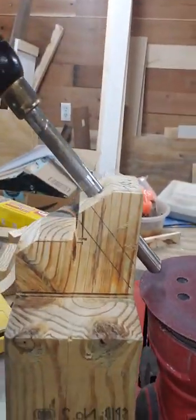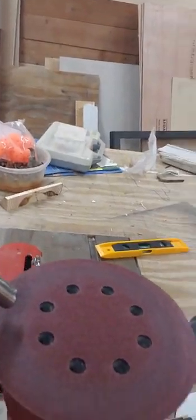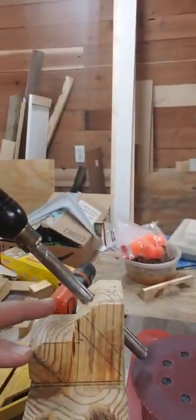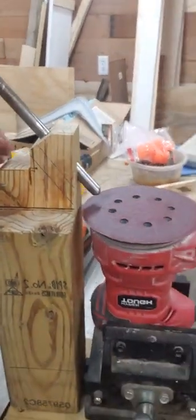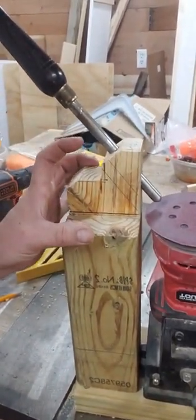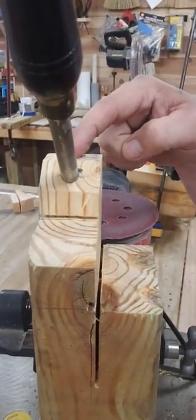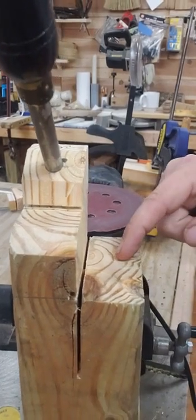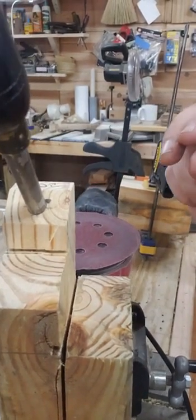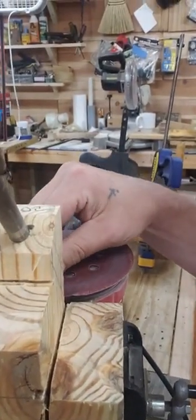This is set to 50 degrees. I notched it here in case you've got a big fat handle — nothing's in the way. You could probably do a 50-degree angle on one side and maybe a 35-degree angle on the other if you want a big sweeping bowl gouge grind instead of the little toenail angle.